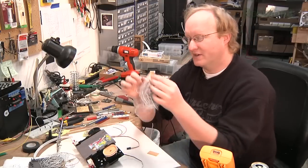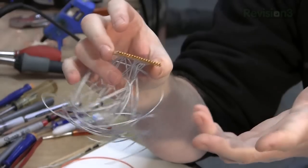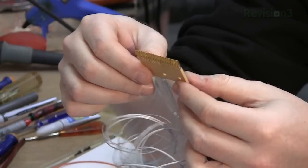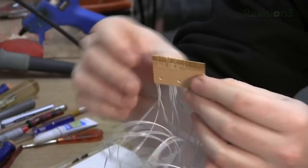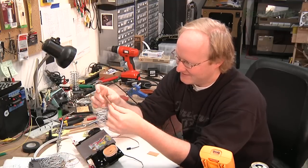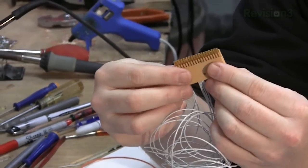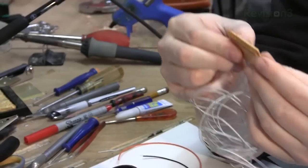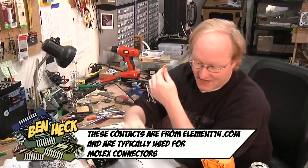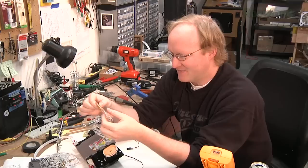This is the main loading mechanism. I also worked on a connector for the cartridge. Nintendo's cartridge pitch is not standard — typically something that size would be 2.54 millimeters pitch, but Nintendo is 2.5 millimeters. Pitch is the distance between center of contacts. So regular perf board you can't use. I actually 3D printed this plastic piece and you put the Molex contacts onto it and then solder it. It has a top portion which matches up to the screw holes and pushes down on the contacts so they don't get bent backwards. With 3D printing I can put the screw holes wherever I want and control the spacing.